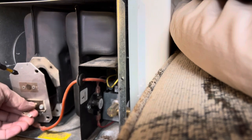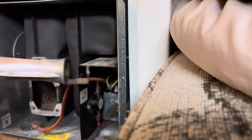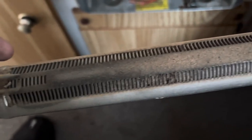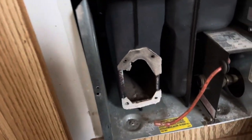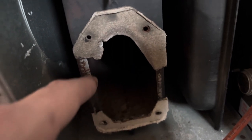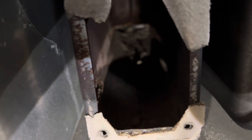So I'll go ahead and slide this burner out. It could be full of carbon. Yeah, it looks like it's just packed full of some kind of dust. You can see inside there — this is the gasket I'm talking about. It looks like somebody's taken this off before and they didn't put a new one on. This needs to be put on, as it can allow carbon monoxide to get into your RV, so it's very important that you do it. You can see inside there, it's quite a bit of buildup.